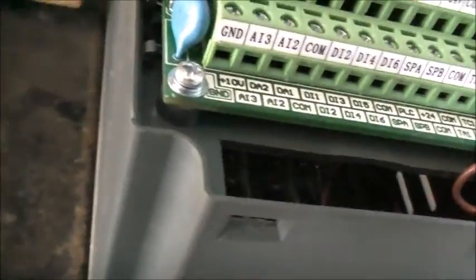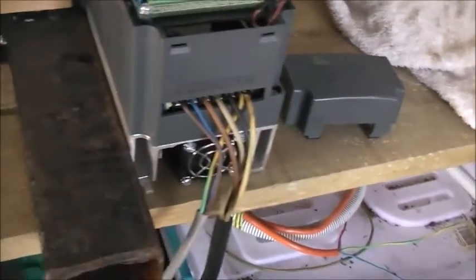It will actually make this whole setup actually useful. So if it's a warm day but not hot, you can have it regulate down to a lower speed. And if it gets to about 40 degrees Celsius plus, the PLC temperature controller will tell the drive to increase the speed of the fan. Sub-cooled heat pump has a video on how to do that with a condensing unit.